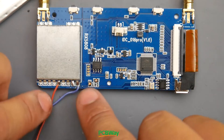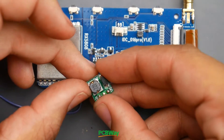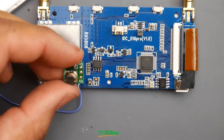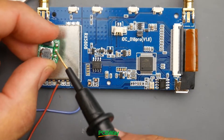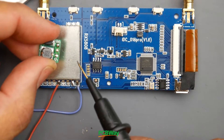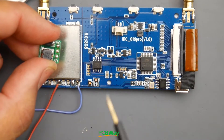Now let's bring back our board here. Remember how we took the battery voltage and the ground? We're going to go ahead and grab the step-up converter. As you can tell, we have VI, VO, and a middle pin. The VI is the voltage in — that's going to be coming in from this one. This is going to be ground, which is going to come from here and also go to whatever we want to step up to 5 volts. And the VO is going to be the positive 5 volts, which is going to go to the DVR.